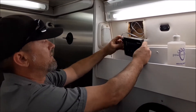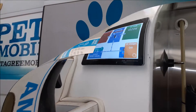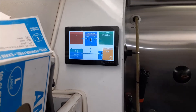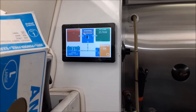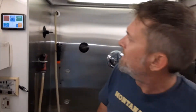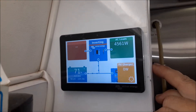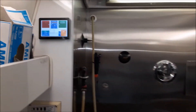We're going to have a bracket that fits over here to get rid of this. Right now we're pulling 23 watts. I'm going to turn that one on — that's 1,411. Let's turn these on. Wow, 3,576 — pulling 79 amps out of the battery. That's awesome. Everything is running. Now we're at 4,290... 4,494... 4,561 watts pulling 104 amps out of the battery. That's pretty incredible.